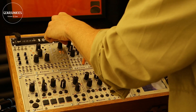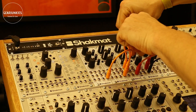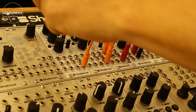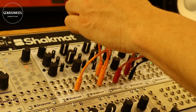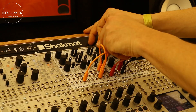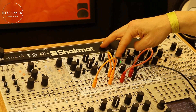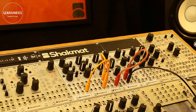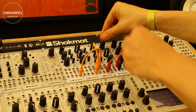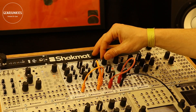Let's take a square wave and add some feedback and resonance — you get this bubbly filter sound. The switching is currently not clickless but will be at final release. The gentle modes include a band pass, high pass, and LPG. For the LPG, you get an analog optical simulation of a Vactrol, so you can ping it and get the same kind of response as a Vactrol. The second family is the MS-20 style filter with low pass, band pass, and high pass. The last option is a very clean VCA.